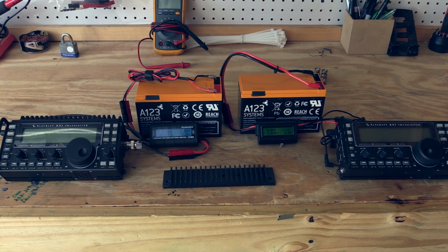One thing that sets this one apart from others is they include instructions for 3 different ways of installing this on your radio. The first way involves simply removing the factory heatsink and attaching this replacement one. The second way involves removing the factory heatsink and using thermal paste to bond to the new one. And the third way involves actually opening up your radio, thermally bonding the PA transistors to the case, removing the coating from the outside of the case, and then thermally bonding the heatsink to the case itself, which would in theory be the most effective.